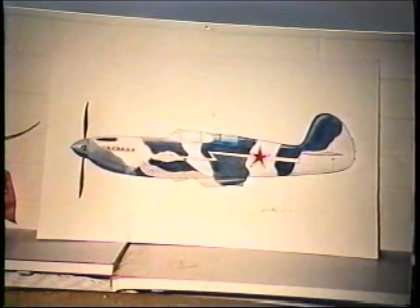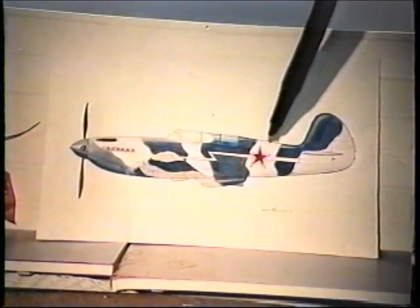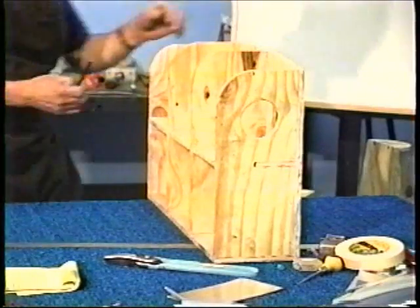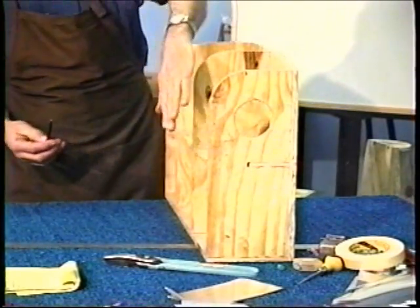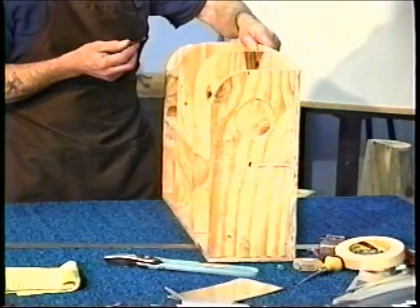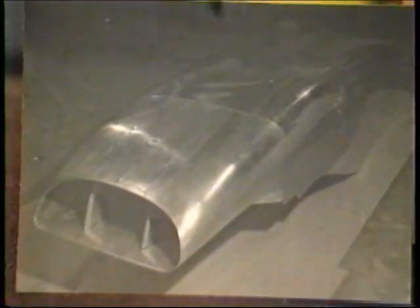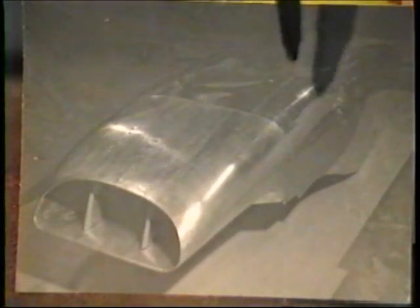Here's a practical application for that last buck we were talking about — from the cockpit back to the tail, wrapping around on top here. This is the buck that we would call the bulge up. The other one bulged out, so that differentiates between the two, and we'll show you a picture of an application for this particular panel. This is a P-51 belly scoop and just here is the panel that we were just talking about. It's the bulge up — you can see the application for it quite clearly here.